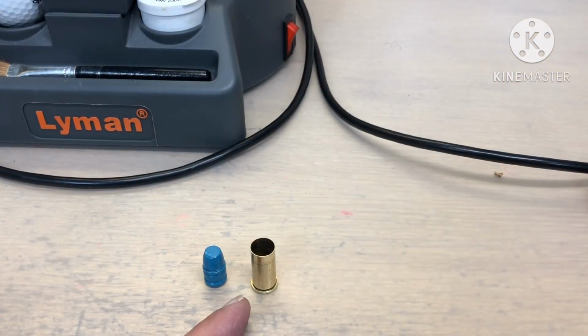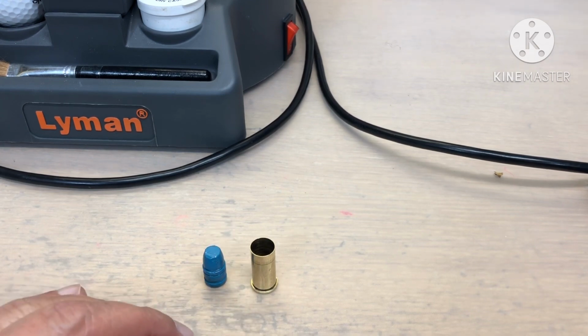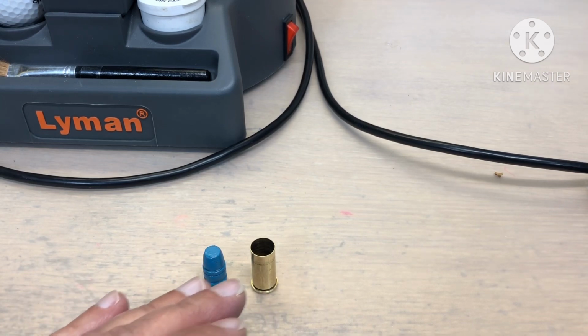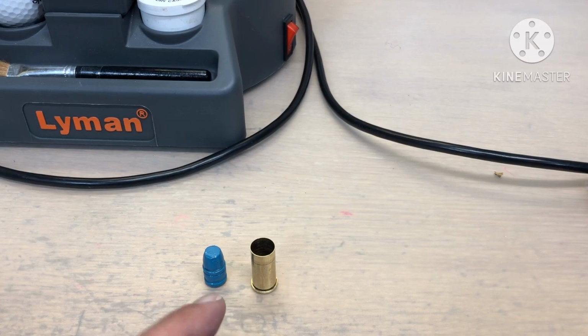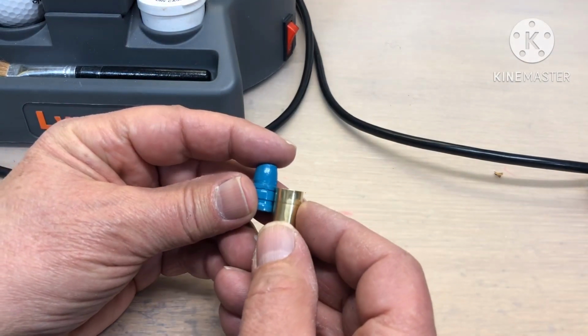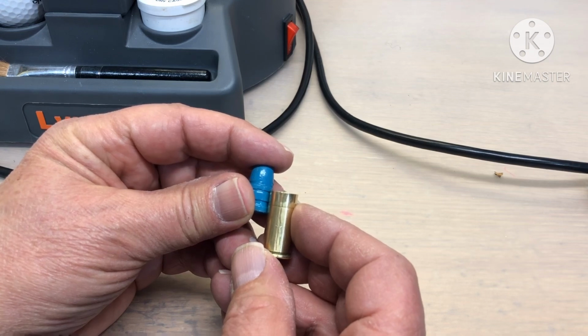Okay, so this was a really beat up dummy round shell. Cleaned it up a little bit. We trimmed her down to 0.990. A Russian is 0.965, so it's like a Russian Magnum, and I'm liking this length or something similar because I can still load them warm or really light and not worry about powder volume or dead space.